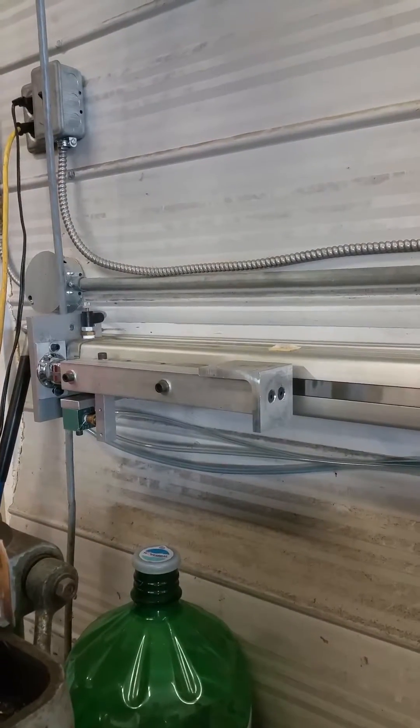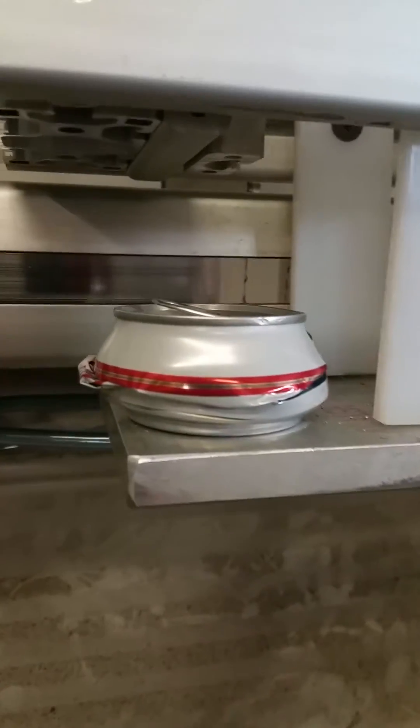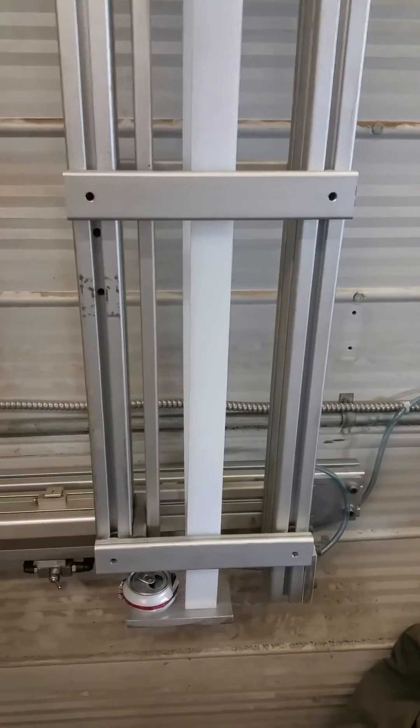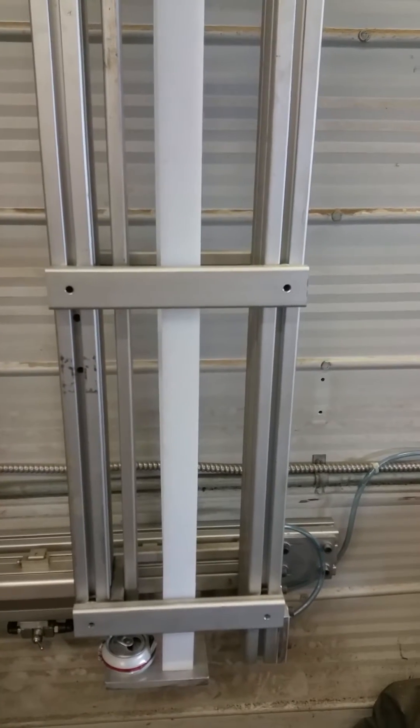And that's the end of the cycle — as you can see it does a pretty good job of crushing the cans down. This section can lift out and make the hopper big enough to hold king cans, and it just slides back in. That is my fully automatic, fully pneumatic can crusher — thanks for watching.